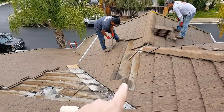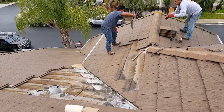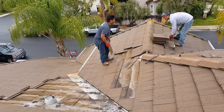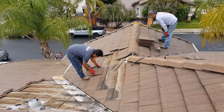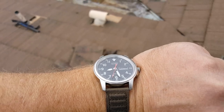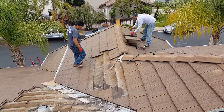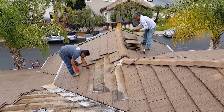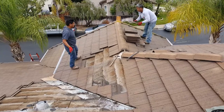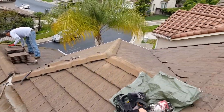The felt paper is really wet right here — the leak is right in this area. We're not going to do too small of a repair; we're going to remove this whole section of the valley, cut it all out, check it, repair it, and stack everything safely aside. It's 8:35 and we started less than 15 minutes ago — you can see how efficient we are. This is basically all we do, so we know exactly where to start and what to do without having to think about it.